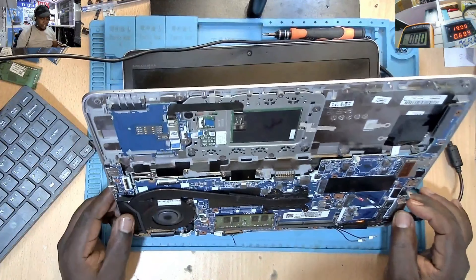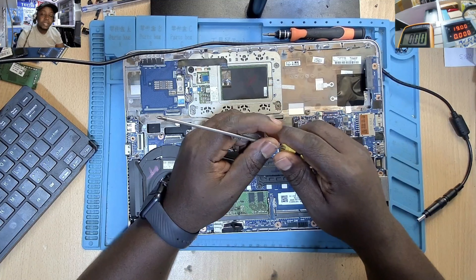It's either the RAM is faulty or the port is not okay. Try to check the port — whether it's clean, whether the RAM is clean, whether the RAM is faulty. What else? The screen — your laptop screen could be having an issue. The screen connector could also be having an issue. To find out, look for another laptop, take the screen out, switch it with another laptop, and if the screen is working then the screen is okay. You can also change the screen connector from the motherboard to the screen and see whether that works.